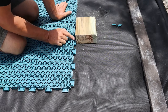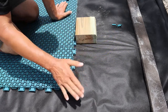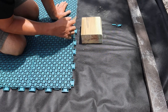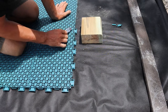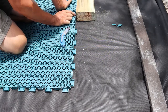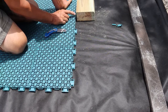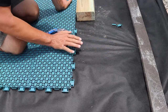What you want to do is allow a little bit of give or breathing room between your border and the drain tile. If you run it up flush and this expands, the drain tile has nowhere to go, so it's going to start buckling — you'll get raised humps, bumps, and buckling underneath the turf throughout your project. So you want to cut these off and give yourself approximately a half inch or less than a half inch on all sides. That allows this to expand, providing a little bit of space so they won't buckle.